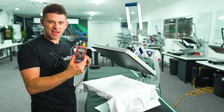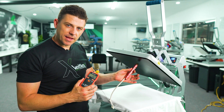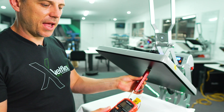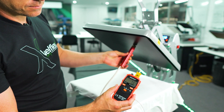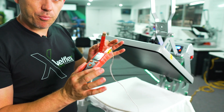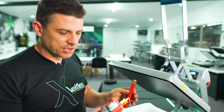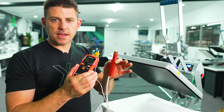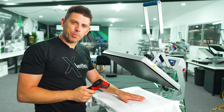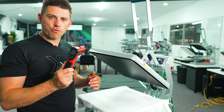That's the way to do it with the gun. With the actual unit you get from somewhere like Jaycar — it's got a little metal pointer, effectively a wire that you hold up against the base. We've just taped it to a bit of wood so it's easier to hold. You effectively just put the end of the metal onto your top plate and it heats up. It takes a little bit to get up to temp and it's a little slower in its process, but temp probes like this are much more accurate — actually touching the top plate and getting an accurate reading. So my recommendation is using one of these. Definitely get down to Jaycar and grab one — definitely worth it. But if you have a gun, use it on a bit of fabric on your bottom plate to calibrate the temperature on the t-shirt. As soon as that top plate pops up, that's going to give you a much more accurate reading using one of these infrared guns.